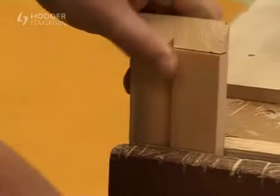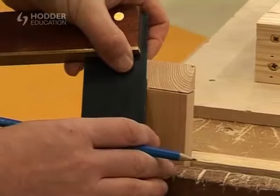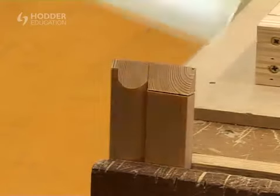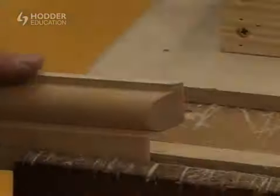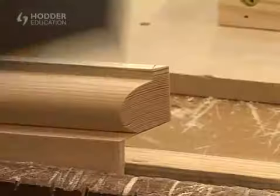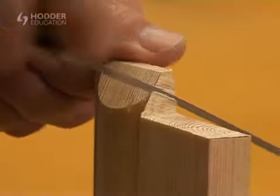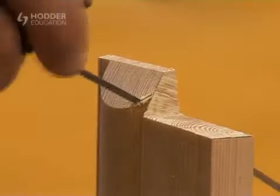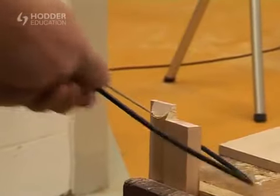Continue to use the tenon saw to make as many straight saw cuts as possible while rotating the skirting vertically. Use a coping saw to follow the edge of the mitered saw cut to remove the profiled area. Take care at this stage to ensure that the coping saw blade is cutting square to the face of the skirting, at the same time as raising the blade to undercut the joint.